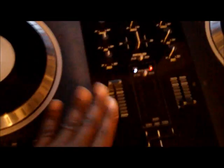So, in order for me to explain this, we're going to start by going to this website and explain the Driverack, the back of it, so I don't have to take it apart and turn it around. So, here's the Driverack. Normally, when people get the Driverack, here's your inputs, here's your outputs, main and sub. Now for the input, this is where this goes. You take the output of this and you run it through the input right here, left and right. And now you're left with the outputs.